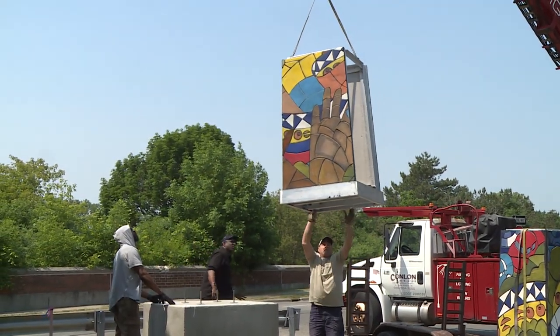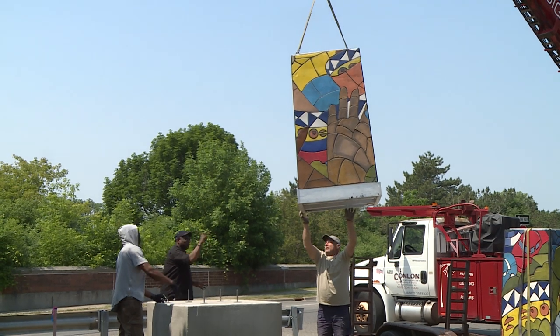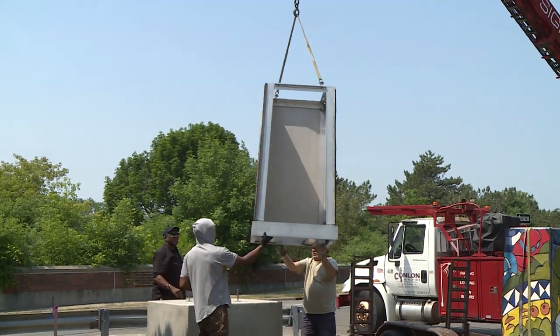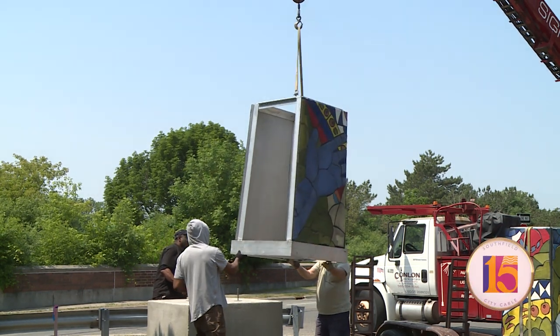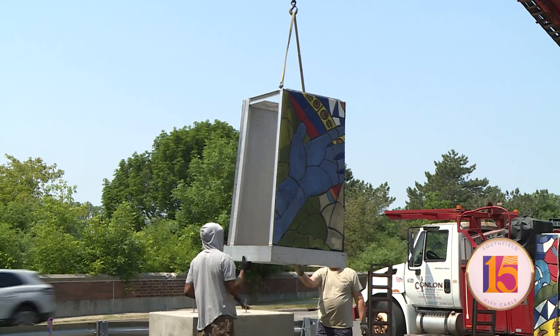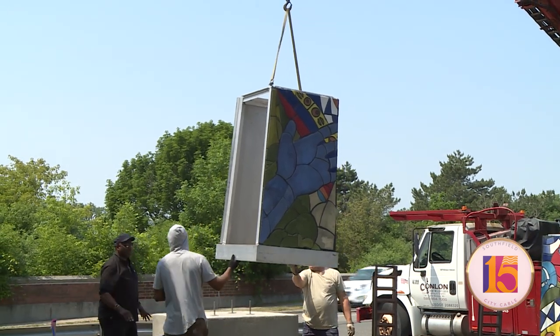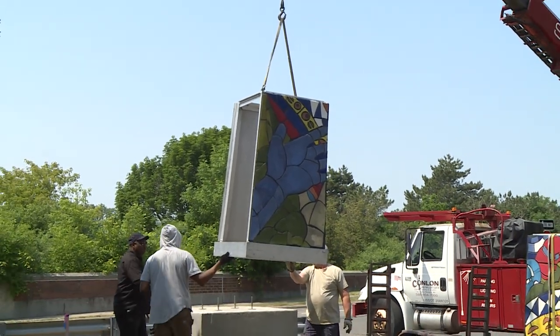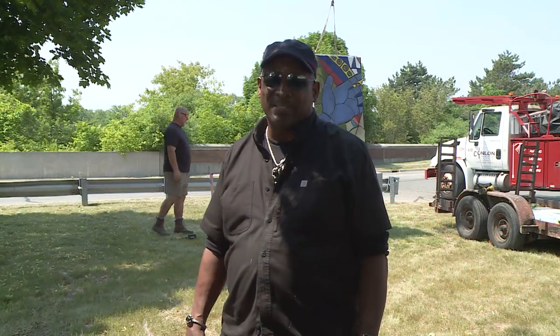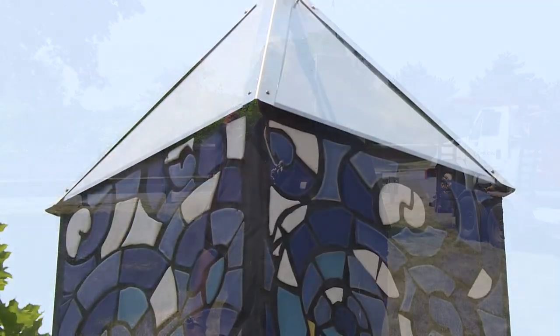The process was that we had to fire a lot of clay tiles. We started off with a slab of clay and then we cut each slab by hand while the clay is still wet to create the shapes. Once the shapes were done we had to bisque-fire it and then we glazed it. It took hundreds of hours to do those tiles.